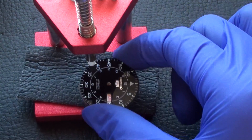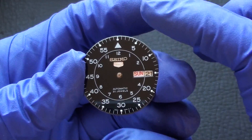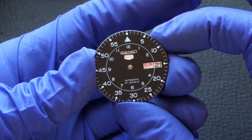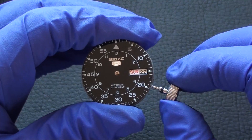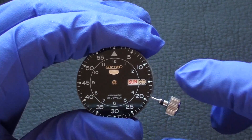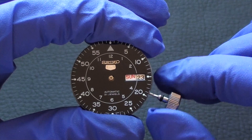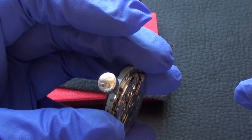For watches with complications, mostly a day and date, I would recommend making sure the movement is exactly at the 12 o'clock position in terms of the minutes and hours hand. The second hand doesn't really matter, but you want to make sure the hour and minute hands are going to be at 12 o'clock. Just because the hands look like they're at noon doesn't mean the movement corresponds to noon, and it's especially hard to know the movement's position without the hands there. A tip I can give you is to install the stem back onto the movement, pull it out all the way, and just wait for the date change to happen — you want to stop the moment the date window changes. As you can see it's starting to change, meaning the minute hand is somewhere around the 50 to 0 position. That's perfectly at the 12 o'clock position. Once you know the watch is at 12 o'clock, I like to remove the stem so it doesn't get in the way when I install the hands.